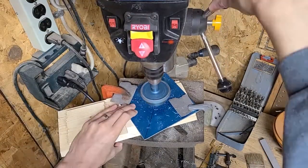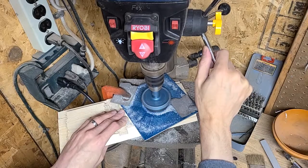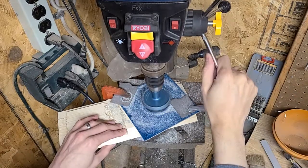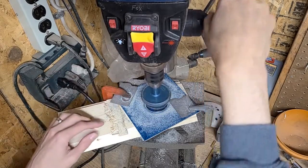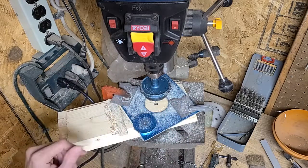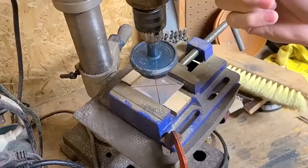I considered doing this in the lathe, but I admit I am terrified of turning a big square object that I cannot mechanically secure to the chuck. I would have had to use glue and attach to a plate that then would be held by the chuck, and I don't like doing that. So I improvised it on the drill press. Yeah! It's hot, hot. This little piece here will support the inserts for the smaller drums from the inside. I'll attach it on the bottom later.